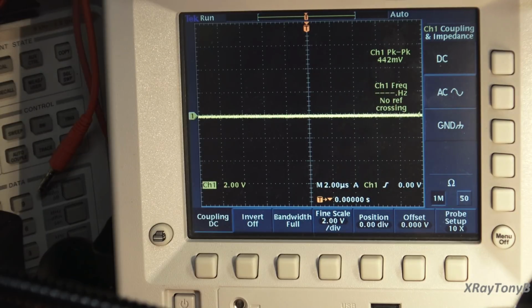So now I'm going to go through the meticulous task of checking each and every bit to make sure they do toggle. So I'm just going to go down the line and check all those, and then we'll see what happens. I'm still not getting it to tune, and I think I said on the last video I didn't believe this was the only problem. This would just have been another problem. I think I still have a bad transistor.